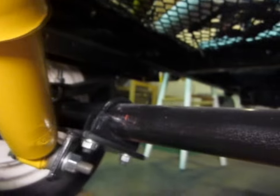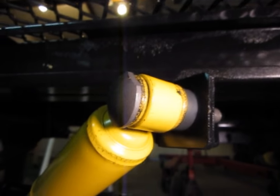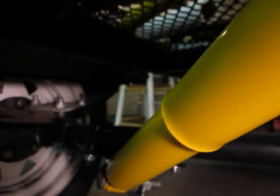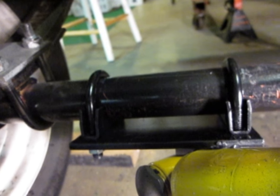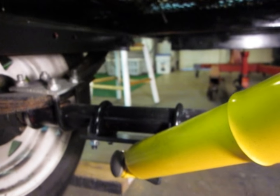The shock absorber is now in position on the plate that I've ended up making. I had to make an adapter up here to create a hard point so that the shock bolt could go through and be used in that manner. The one down here is screwed to the big plate I showed previously. The only change was to get one of those square construction nuts with a half inch hole, available at hardware stores, and weld that on there. This is a 45 degree angle, and the same up here — 45 degrees — so that they work in line, with an outward spread like I'd wanted.